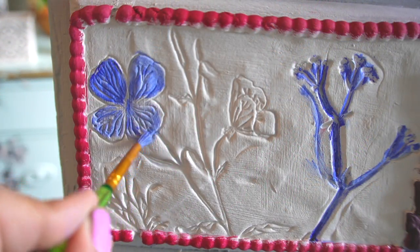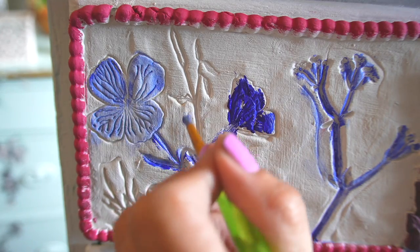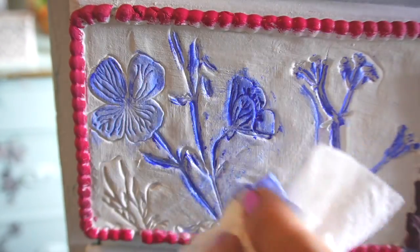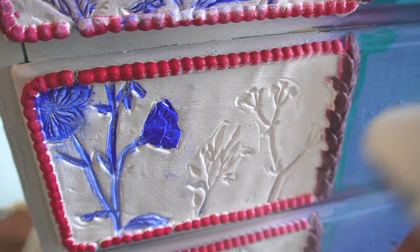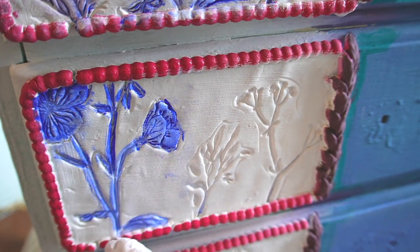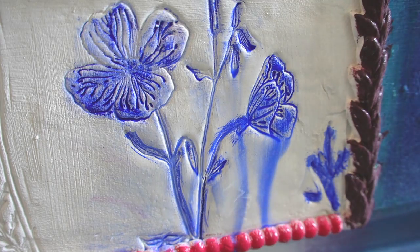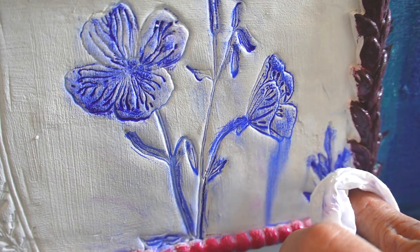Shortly after that she created a tutorial, and I called her up and asked if she would like to come to the DIY boot camp and teach a workshop on blending in real life. One of the great things about clay paint or chalk-type paint is that you don't have to sand or prime in most cases, which eliminates a lot of prep work. However, prepping your surface is really important when it comes to blending, especially with DIY paint. When you first put that coat on it's going to dry really fast — let it dry overnight, because a wet brush or a second coat will reactivate the paint and you will not have nearly as much control. It's kind of like priming a canvas with gesso.